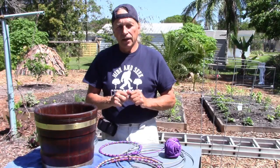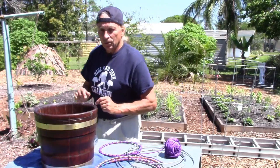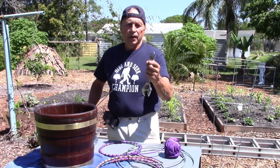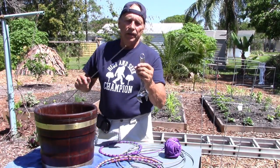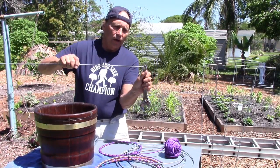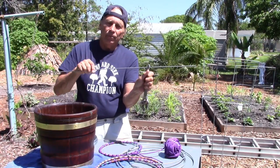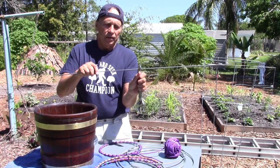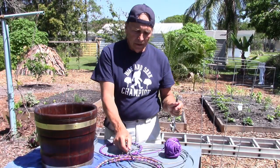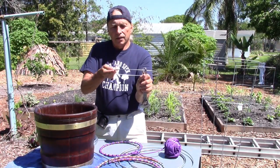The other method that I use, which is real slick, and most people have this around, and I'll go get the tool, I use a crescent wrench, and what I'll do is I'll clamp this in the vise, and I use this hole and I'll place my wire in here and I'll just keep nudging this way in the vise a little at a time. It'll make a slow curve. And after you get the curve, you'll just repeat it until you're done, like this. And you're nudging.